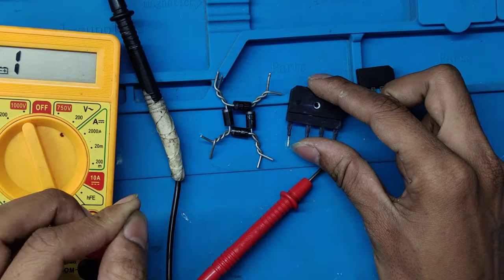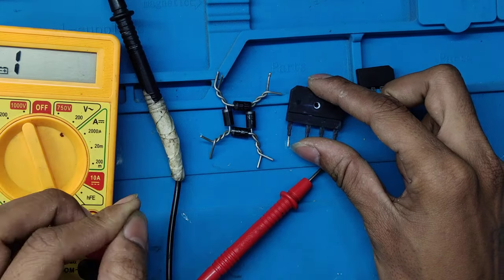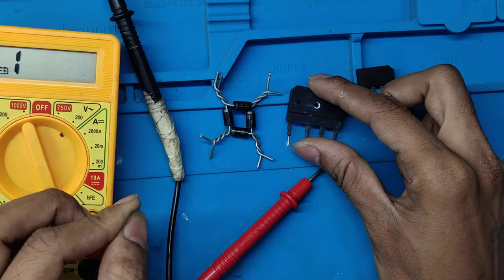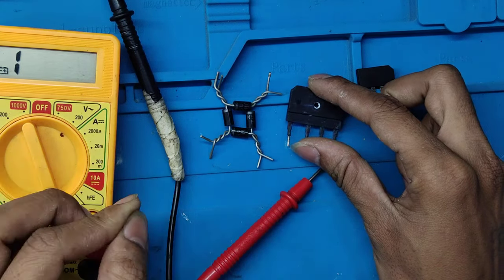Because in a rectifier, suppose you have a 12-0-12 input — what comes out may read 11-0-11. That is just an example. If you have a 12-volt input, it will drop slightly. The efficiency is not perfect. There is also about a half-volt drop. If you have a good-quality diode, it will be only about 500–600 millivolts. But in some cases it can be 600–700 millivolts, meaning that at some points it will drop your voltage.